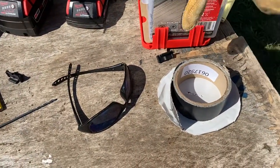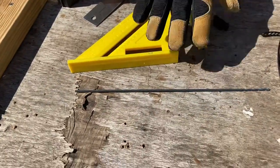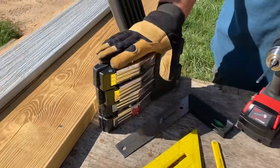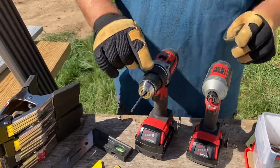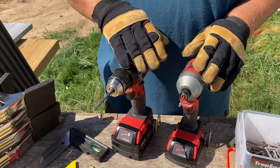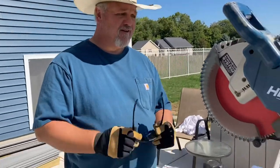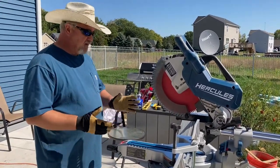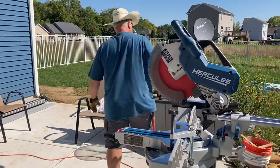You'll need some butyl tape — we'll get into why later. Safety glasses — I'll actually wear them this time. You'll need a long one-eighth inch drill bit of high quality, a carpenter's triangle, a pencil, a carpenter's square, some clamps, your decking material, a drill with a 5/32nd central drill bit, and an impact driver. You can get away with just a drill, but it's worth it to have both. We'll also need a chop saw.